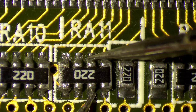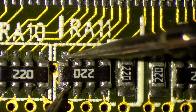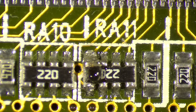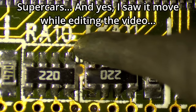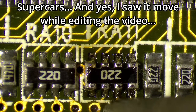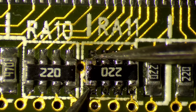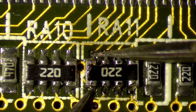22, 22, 22 — but then 37, 27 — this one is not good. Let me reflow this quickly and see if we get something different; maybe I don't have to replace it. That was such a random coincidence to look here. Let's check again — nope, this one still doesn't work.